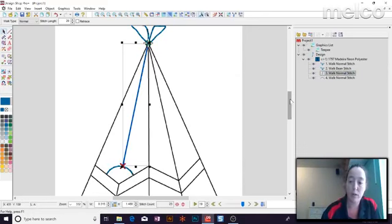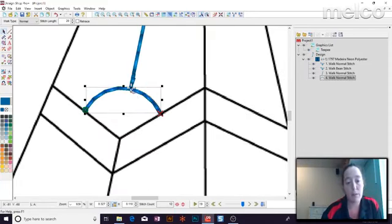All right, so I have an arc. Well, my start point for the arc is nowhere near that, so I'm going to zoom in down here and show you how we can split this apart so we can still get our 4 pieces of thread. So I'm going to put a point here and then use split element at selected point. So now I've got 2 halves of a circle, this half and that half.